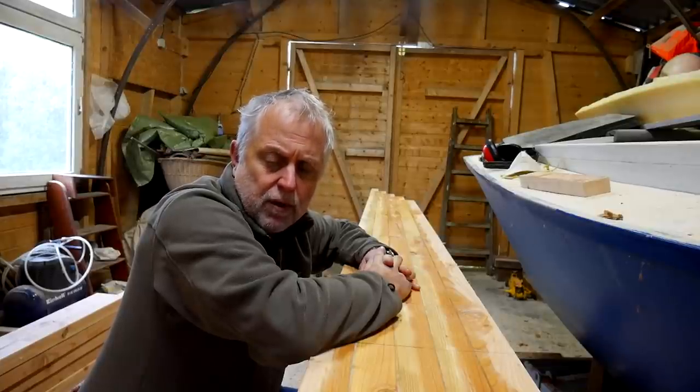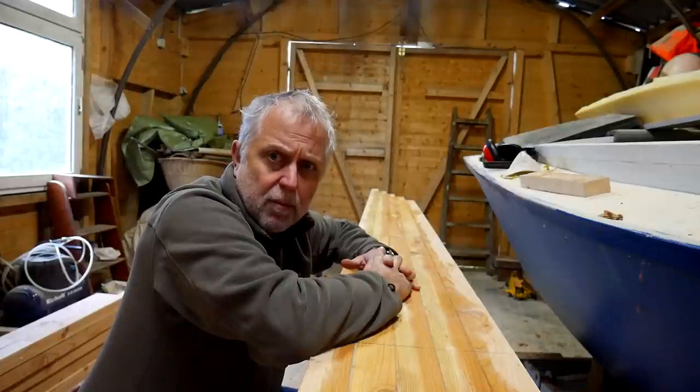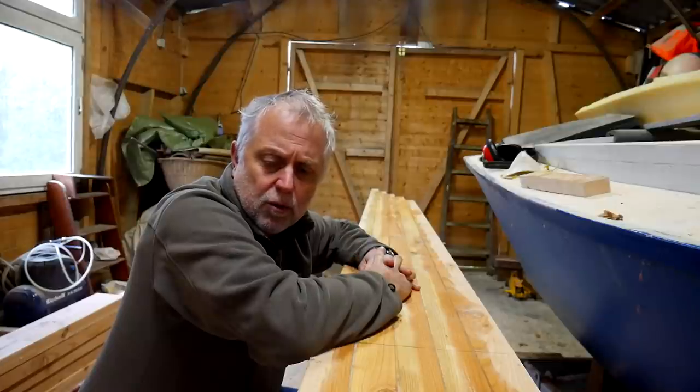And then they'll be coming up, let's say, fixed in the lead, up through the timbers, obviously, and pouring, as I've just said, pouring epoxy around them to seal everything completely. I'll put thickened epoxy on the top of the lead so it comes up and it's all completely sealed, waterproof, watertight. Should be good, we hope.